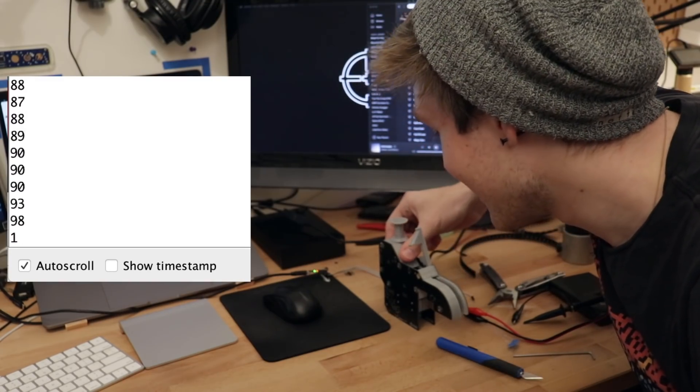The final piece of the puzzle is getting data from the optical sensor out of this — that tells the motor how far it's moved so it knows when to stop, ensuring the tape has moved forward exactly the right amount for the next part to be served up. It's outputting data over the serial monitor, and when I spin it, sure enough it does all the bits. Now the last step is getting all of those little parts working together in concert — so the tape moves forward exactly the right amount, peels the film off, all that good stuff. So close now, it's just writing a lot of code.